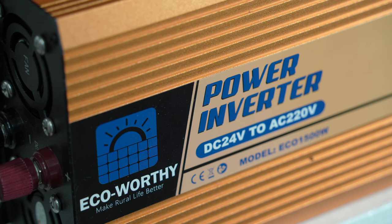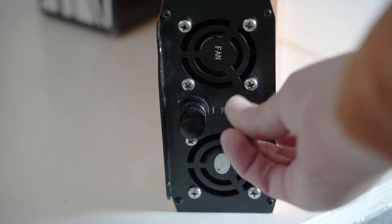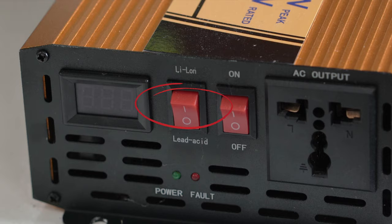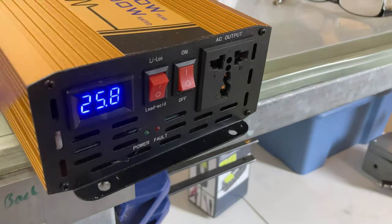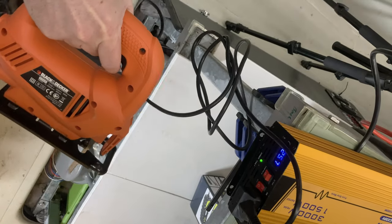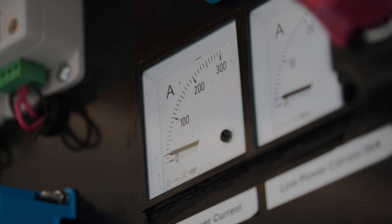It's a well-regarded company and slightly harder to come by than one sourcing from 12 volts. It's not complex — there's a pair of screws at the back to attach your positive and negative DC, and a single UK AC 13A plug socket on the front. Plus a lithium or lead-acid selector, and a source voltage display so you know if you're pushing your luck. I proceeded to release electricity from the high power isolator switch, it zoomed over to the inverter, which confirmed the appropriate number of volts. It powers up a jigsaw — a Black and Decker, I love it — and the ammeter I installed back in the Covid days jumped into action, which is endearing.